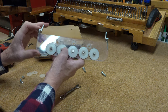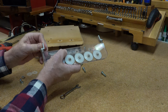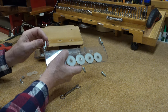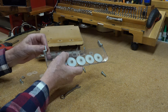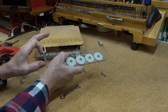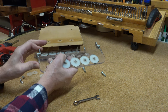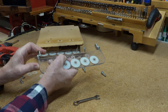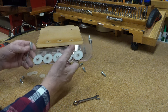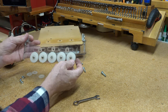These next pieces simply have a half-inch slop with a spring. You don't get a full half inch of travel but you don't need it — all you need is for it to move up and down a little bit with the tiny variations you're going to have for warp and whatnot in pieces of wood. If you wanted more travel, you can screw the screw out a little bit. I have it tensioned to put a little more pressure downward on the wood. These aren't very strong — maybe a pound of force, maybe a pound and a half against this spring. So two of those together is a pretty decent load on those rollers to keep everything tight down to your surface.